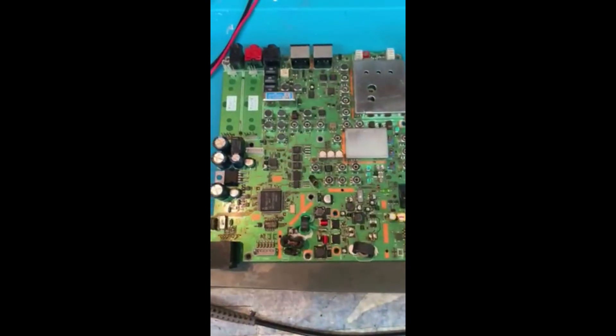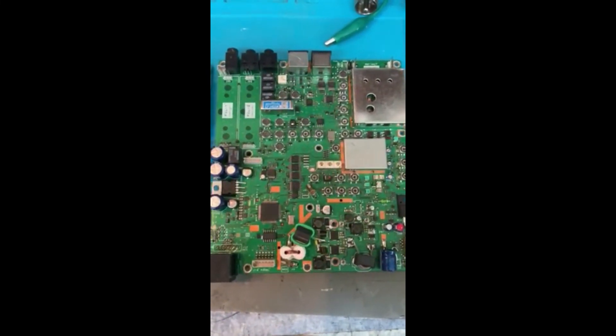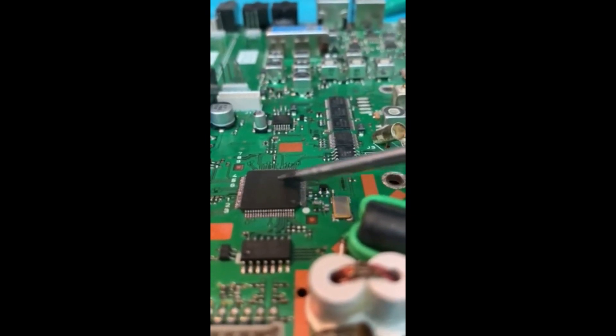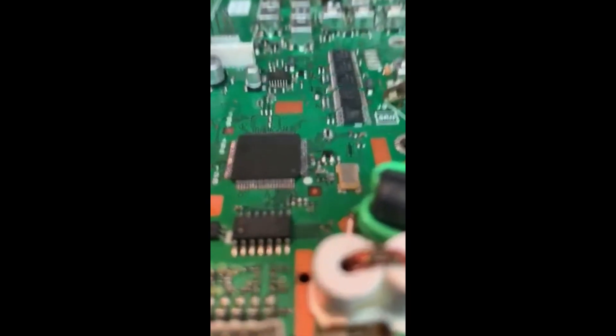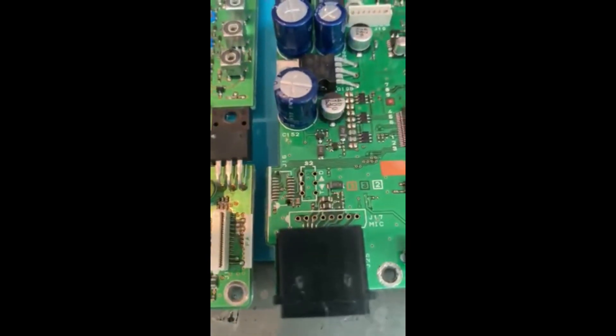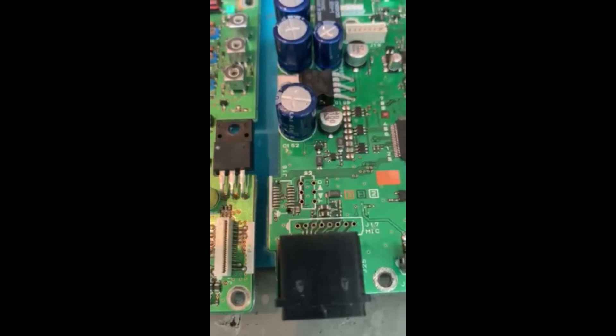Here's a D board sitting side by side with the non-D board. The D board has two significant differences. Looking at the picture circled in red, you can see the absence of the switch and connector in the lower left-hand corner, and the different physical shape of the microprocessor used on the D. The D's micro is a lower-height device, not nearly as thick. The lettering on the micro is typically not as bold as the non-D version. The other obvious difference is the missing connector for the DSP and the switch — you can see the outlines of the switch and connector, but those are now gone.